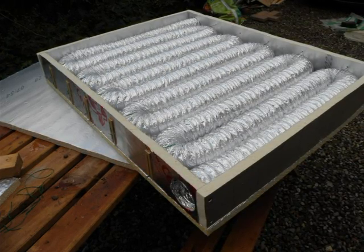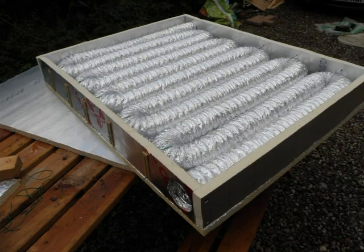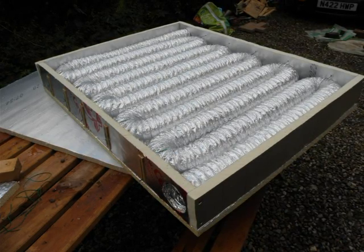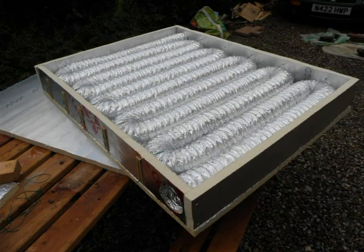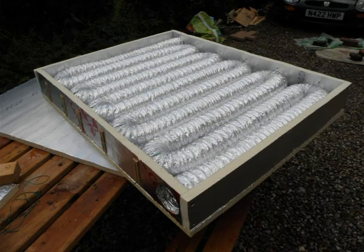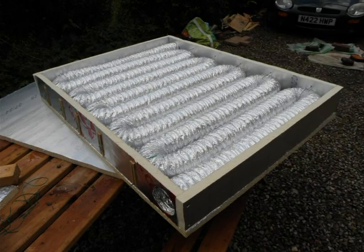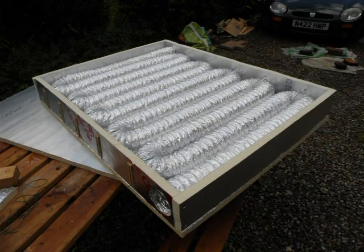This is a 10 meter coil. It's aluminum foil with a sort of reinforced wire stiffening throughout. It's also plastic coated on the inside and has a surface which is angular and crinkling. This has two advantages: one in that it actually absorbs more heat — it has more surface area to absorb more heat from the sun — and also it allows the airflow through to become more turbulent, which allows the air to pick up more heat.